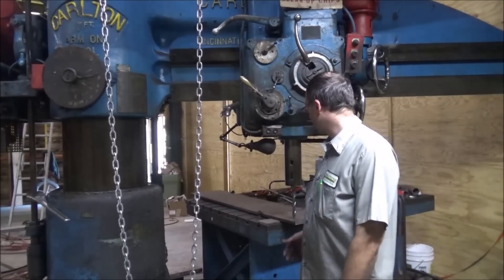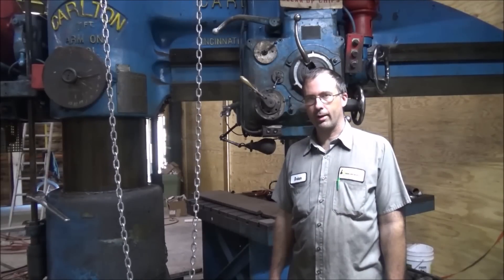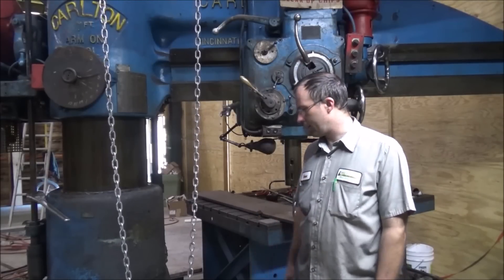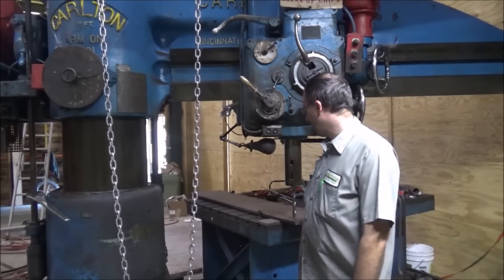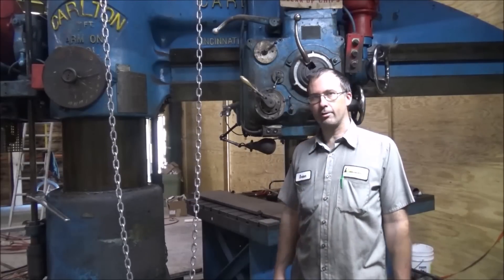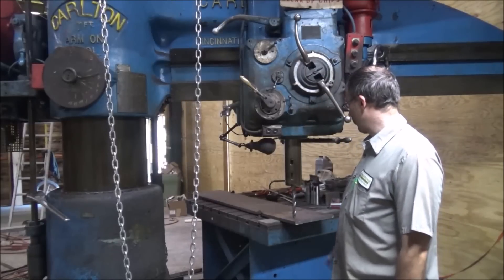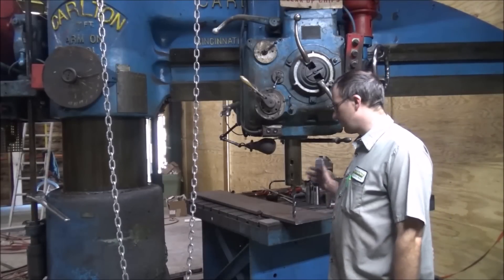Although it's plenty small for a drill that can handle a four-inch, I don't have the power for it right now. So I'm going to drill this plate that goes on the side down here — I'm going to put it on as a brace. It's one inch by 12, and it's five foot long, so it's a little over 200 pounds. Pieces like this are not the most fun to move around because they are fairly heavy, so this is a good use for a machine like this — you can put the workpiece stationary and move the head around to do all your drilling work.